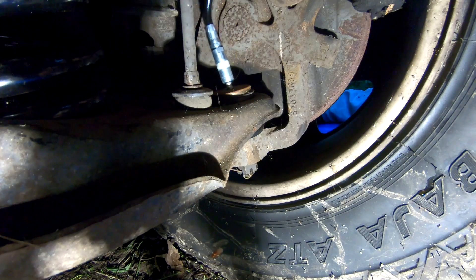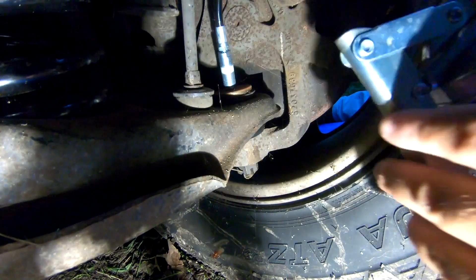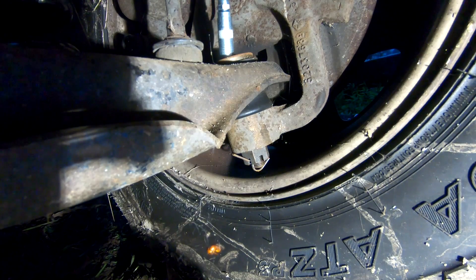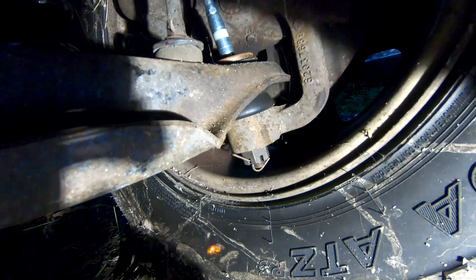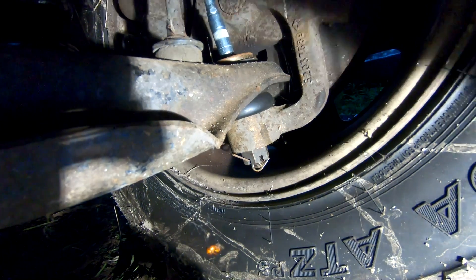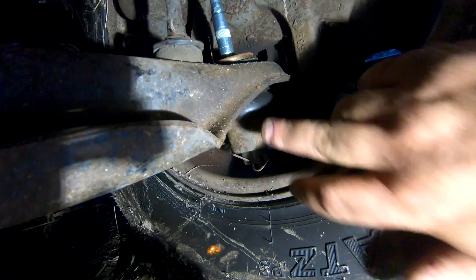Now I'm gonna get down here to the bottom and do the same thing. See this bellows — I don't know if you can see it, let me get you a little lower — because it acts as a bellows and not just as a water seal. So what you do is go ahead and pump grease in. You see it's starting to move — see, it's billowing now. There — see how it inflated? It's full of grease now.